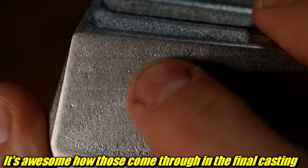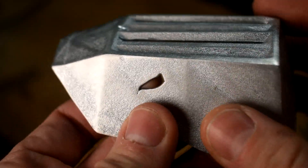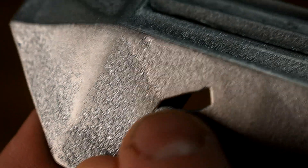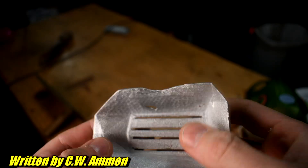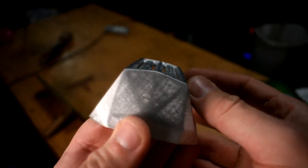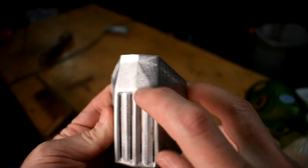There are also visible support scars over here. It's kind of hard to see shiny things on camera, but you can see these lines and rows of dots — that's support material on the other side of the matchplate. Those horizontal lines are in the prints too — I've been getting those with the slicer I'm using, I think Chitubox, and I really need to update it. That's kind of upsetting. At least if there was going to be a hole in it, I wish it had looked cooler. You can see from the way the metal looks around the edge that this was definitely metal cooling off — it almost looks like a cold shut. There's a wave of metal running here, and this leading edge froze and more of it went around the freeze spot. There's a book I read years ago on sand casting that had a quote: 'Don't cast sheet.' Well, this is like sheet metal — it's paper thin. If you were going to make this in mass production, you would probably stamp it out of sheet metal. So if you have something that really should be welded up out of sheet metal or forged, don't try to cast everything just because you have metal casting equipment.